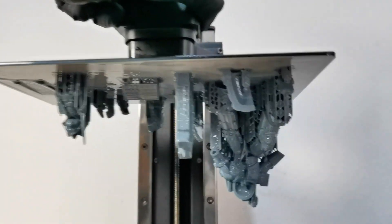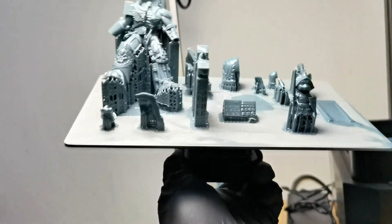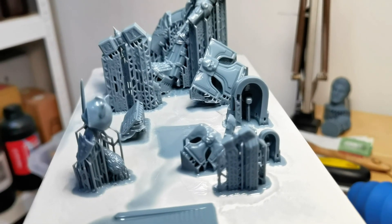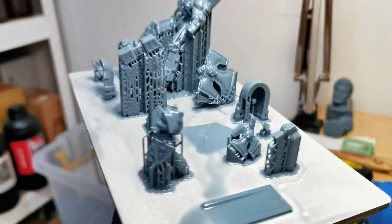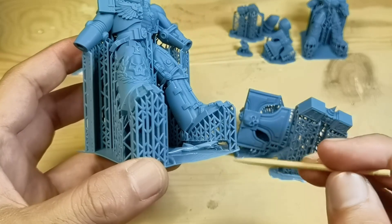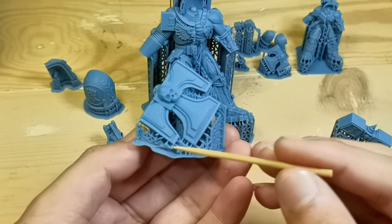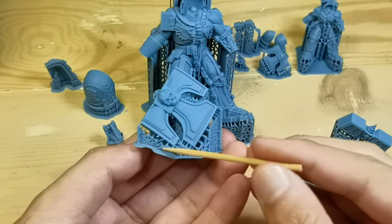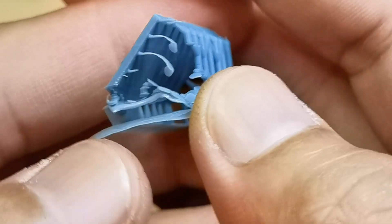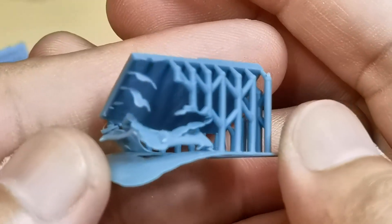The print status detection — I'm not sure whether it works or not. When I switched to a darker resin for detailed prints, my exposure calibration showed 1 second, and I had some failed and partially failed prints but saw no detection in action. The print finished anyway, so at least I could still use it. I ended up raising exposure to 1.3 seconds to reprint the failed model.